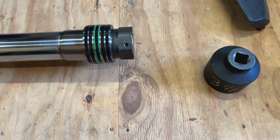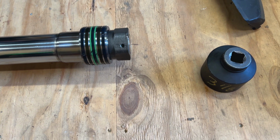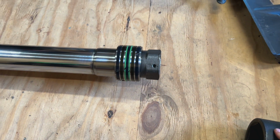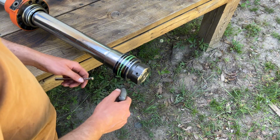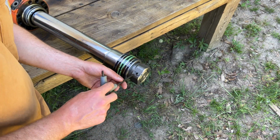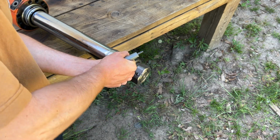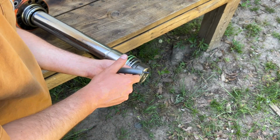So now I'm gonna have to burn 2 hours to run all the way to his place, grab a 2 15/16 socket, which is equivalent to 75 millimeters. So that's fun. There's 2 hours of my life I'll never get back. But it's my mistake anyway, so paying my stupid tax. So here we got this 75 millimeter nut, and we got to get this set screw out of here before we start trying to bang on this nut.